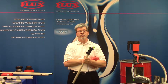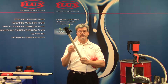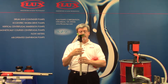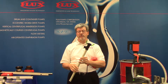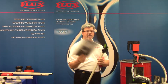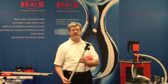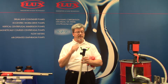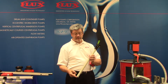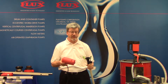The pump tubes come in polypropylene, Kynar PVDF, and 316 stainless steel, in different lengths. The shortest is about 20 inches — perfect for a bucket. Then 27 inch for a carboy, 39 inch is the most popular for a 55-gallon drum, and we have a longer tube for the tote or IBC. A 47-inch poly is coming out next month. Pump length is measured from the inlet to the centerline of the discharge. The 39-inch is the most popular for the 55-gallon drum.